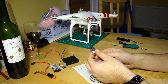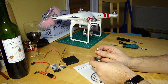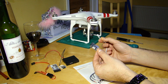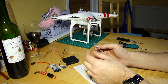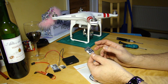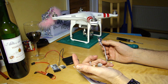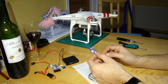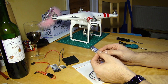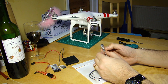If you have a Phantom 2, you can use a standard CAN bus lead to connect to the external CAN bus port, then plug it into the Flytrex — and that's it, no soldering. With the Vision Plus though, there's no external CAN bus port, so Flytrex have come up with a little unit you plug into the phantom's main board with one push. You attach another cable from here to outside where the Flytrex connects, getting both power and data — so you can snip the old leads off. All it requires is removing the lid and pressing this into an empty slot on the main circuit board.